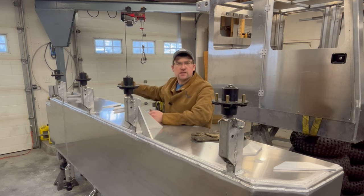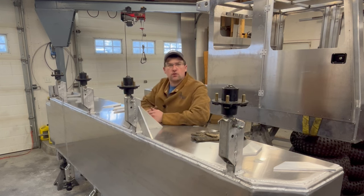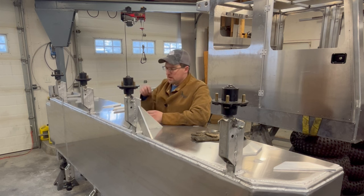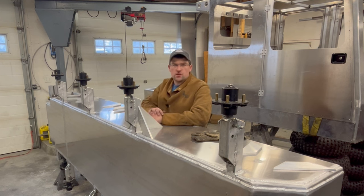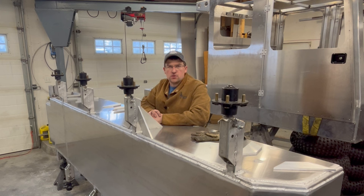There's one more piece that needs to go in, and then a little angle plate that allows some spacing for the wheel motors. And then that's also where I'm going to put some threaded sleeves through the hull. So I'll have like a short 1-foot hydraulic hose on the exterior of the machine, and then inside, it will thread in a new hose that goes to the pumps. So there'll be very, very little hydraulic hose exposed outside to get caught on anything or rupture.